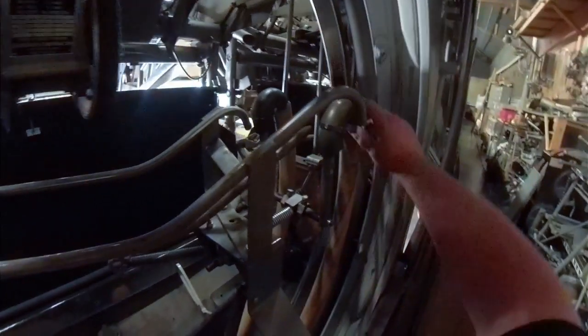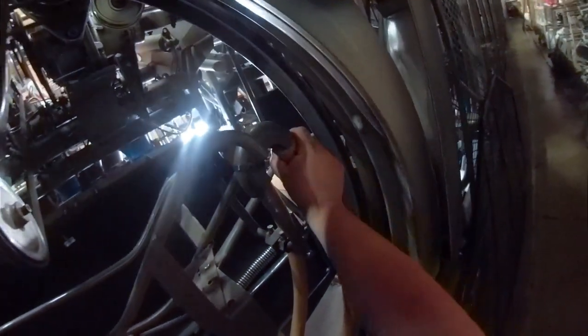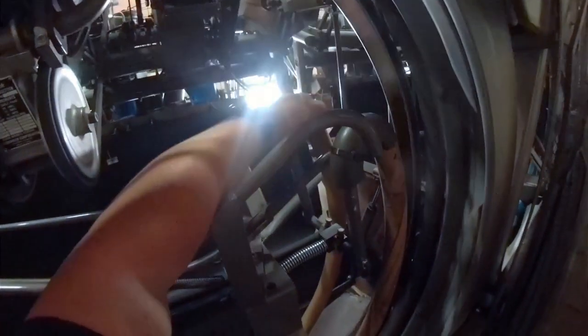These bolts come through just right. These caps should be basically more or less flat. So there's too much gum rubber here at the top. These didn't get trimmed down far enough. It should have been trimmed about there, so this could have sat down right. Same thing with this side. Somebody haphazardly trimmed it, and this cap should be sitting down there.